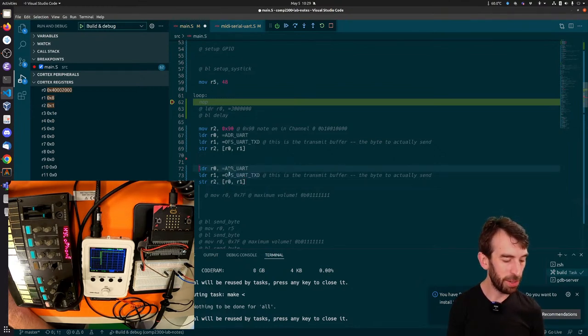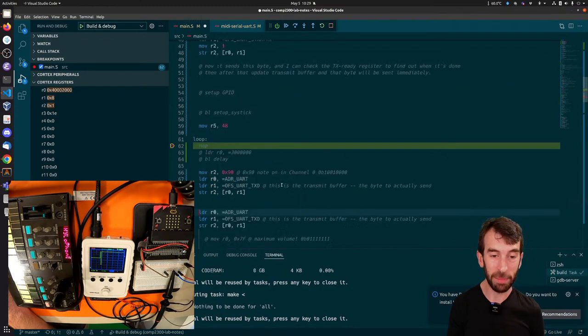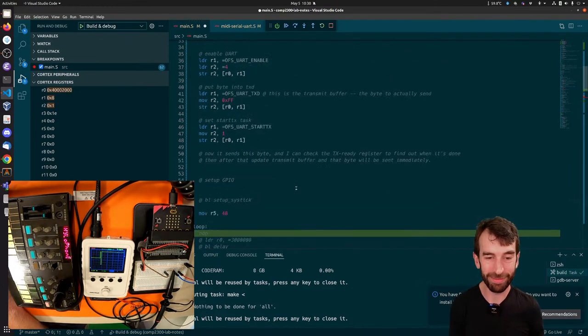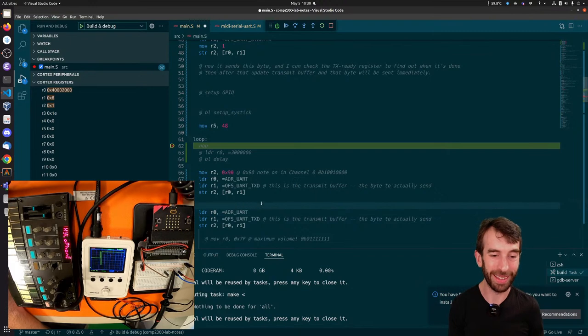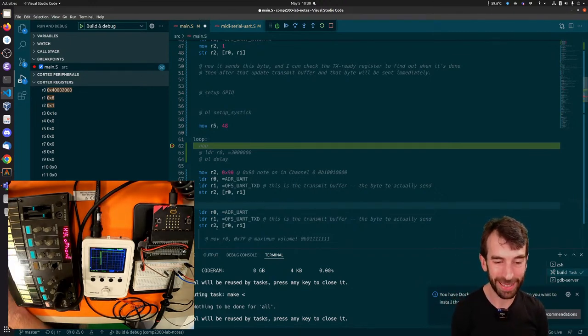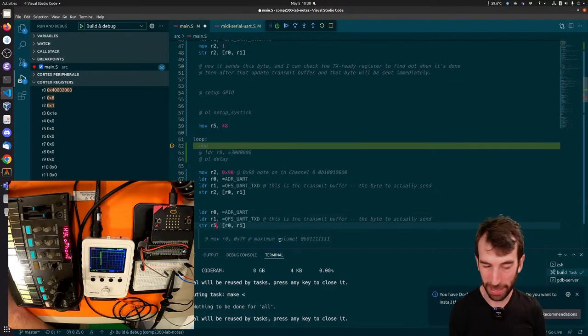The question is, do you always have to start it with some initial byte to send? I believe so, because as soon as you trigger the start TX task, it's going to send that first byte. If I was smart, I would have some way to have the first byte I'm sending be useful, but I'm not smart. I can't quite get myself straight on a way to do it without having that slightly weird first byte.